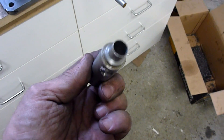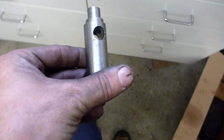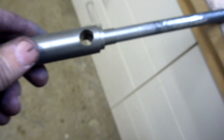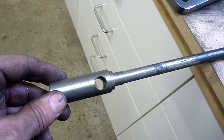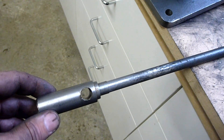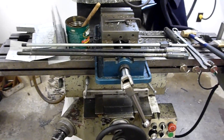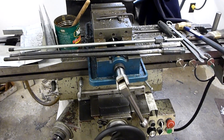Finished piece — just drilled her through there, that's where I'll plug weld it, and this is my shaft. There she goes — it's kind of snug. I'm a little bit under on that size; my drill bit's about a thou shy and the rod's a little proud, so I should be able to just jam that on there. Grab a hammer and she's going — yeah, awesome, so that's gonna work great. I'll just take a welder and weld that on there.